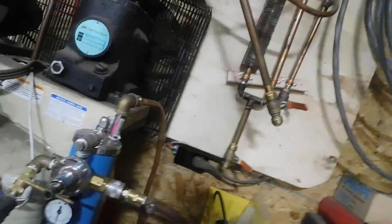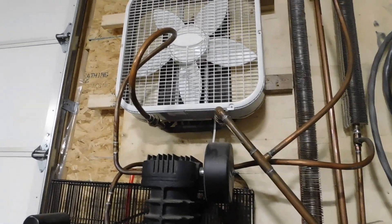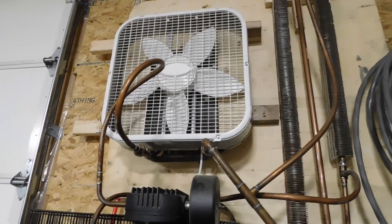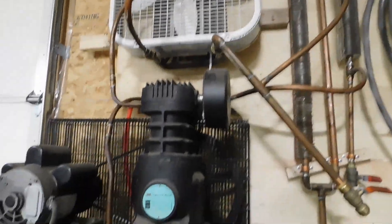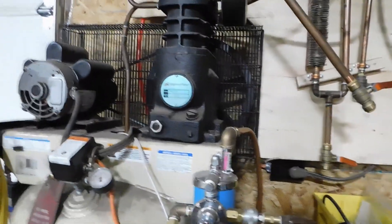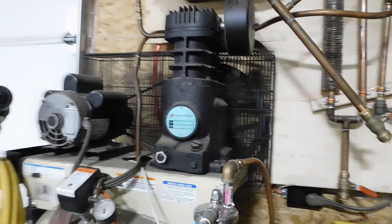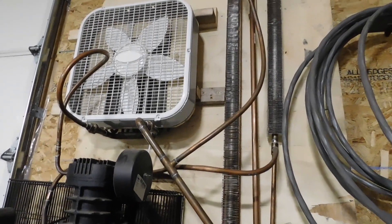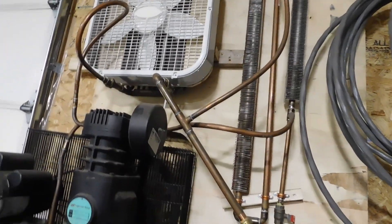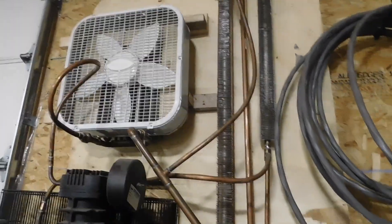For those that aren't really familiar with how these work: warm air can hold much more humidity than cool air. As the air cools down, it basically squeezes the water out of it, but the water needs somewhere to condensate onto — kind of like dew in the morning. You know, the grass will be wet but nothing else will be. Or you set a cold drink down and it's warm outside; when that warm air touches your cool glass, the air cools down, squeezes the water out, and the water needs somewhere to physically attach to. That's why you get condensation on the glass — that's kind of what we're doing here.